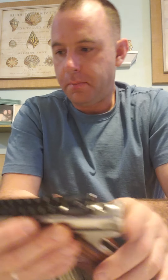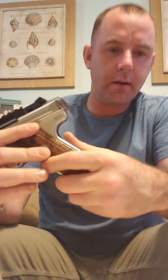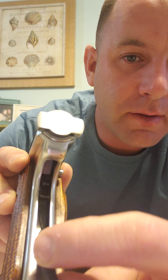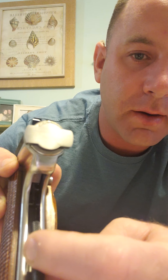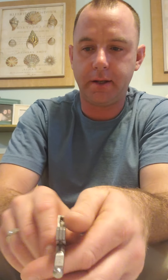Shake that piece down, put it in, and it slides right in. Bolt's in. Now we get to the challenging portion of assembly. Inside there's a piece that likes to go back and forth — that's the challenging part. We have to be aware of where that tab is in relation to this piece here. This piece looks like three pieces of metal sandwiched together — one, two, three — and we want that tab centered in the middle section.